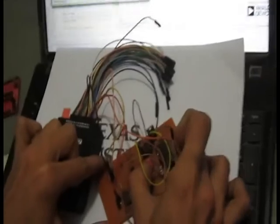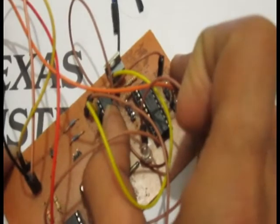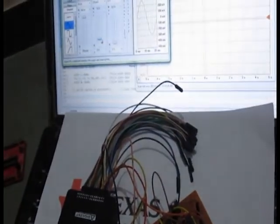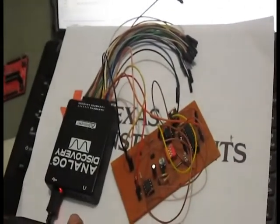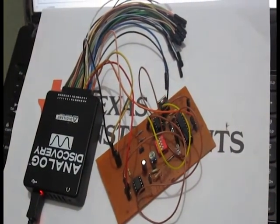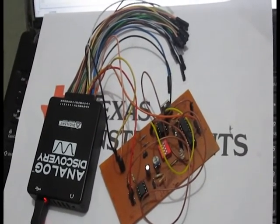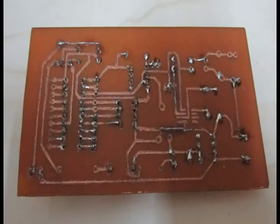And if I change the status of the switch from 0000 to 1111 for the demonstration and reset my circuit, we can see that the threshold value has also changed and the blinking pulse duration has also changed. Create a fault. 3, 4, 5, 6, 7, 8. So by changing the switch status, the LED pulse blinking count also changes, as we can see from 4 to 8.